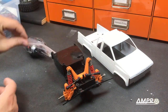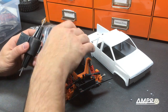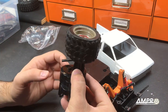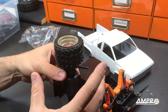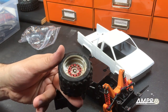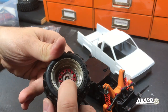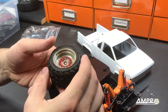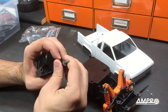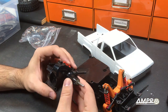As you can see in this little baggie here, we do have the transmission. I accidentally took it apart — I was promising to do this on camera, but it was easier than it seems. There is a press-fit nut on this shaft here. I unscrewed the transmission and just set it in a vice without clamping it down, so the rear tire was just resting there. I took a small punch — not a center punch, because I didn't want to damage the axle — and rested it on the face of the axle shaft. Gave it one hit with the hammer and everything just came apart. The nut on this car shaft is simply press-fit on there. It's quite rudimentary, but it does in fact work.